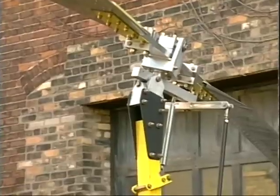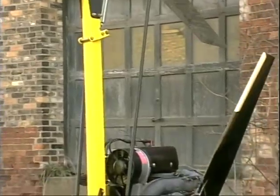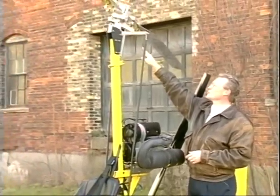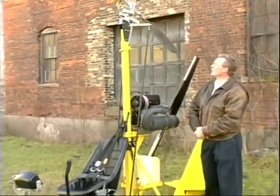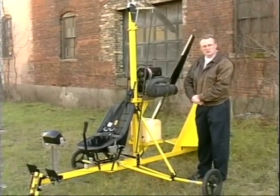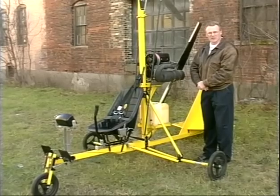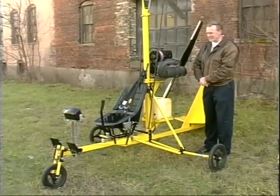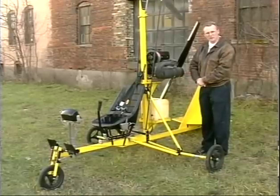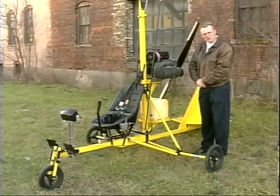Now, what we also have for this system to give the Honeybee Gyro a very forgiving, a very easy feel in terms of flying, are some different throws. We have a longer control arm on the rotor head and torque tube. That coupled with the right feel through the control stick gives you a very forgiving, yet responsive and maneuverable feel to the Honeybee Gyro. It is not typical in terms of its handling ability because it's not a sensitive aircraft to fly. It's very forgiving. In a lot of cases, it will wait for you in terms of both pitch and roll.